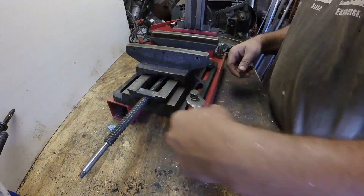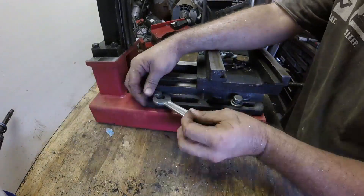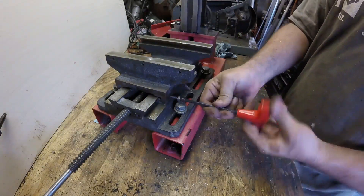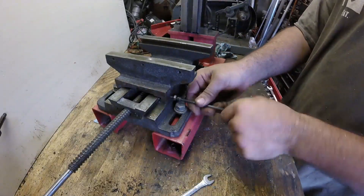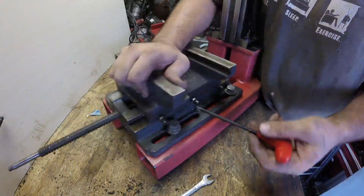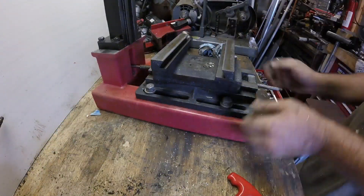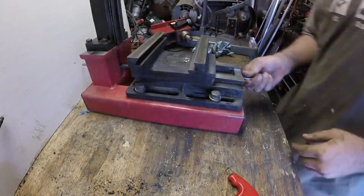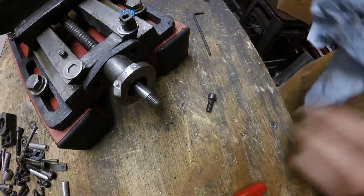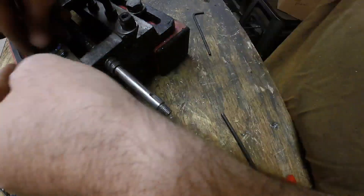We're back on the small CNC mill today. To start things off I'm bolting down the base of the XY axis to the fabricated frame it came on. It's actually got a couple of pins on it to help align it and hopefully make sure that it's square to the column. Look at those gibs — snug but not so snug that the axis won't move. Took a little trial and error. Now I'm assembling the front half of the Y-axis — until I remembered that I didn't oil that bearing.